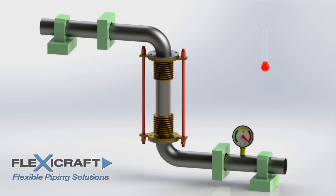If the joint is placed where it will only move laterally but not axially, the added tie rods will never be forced to disengage. This can be set up for piping thermal expansion by placing the joint perpendicular to the main pipe run, as seen here — again, the anchors would be far apart. This configuration can be quite helpful, especially in larger diameter piping systems.